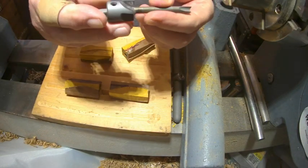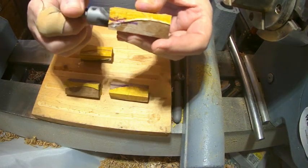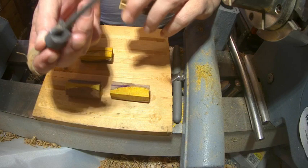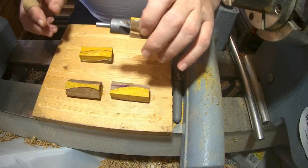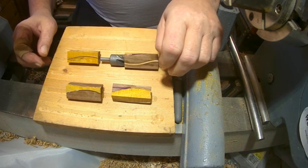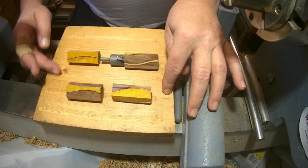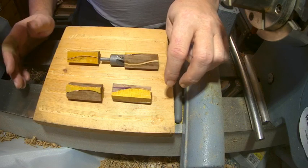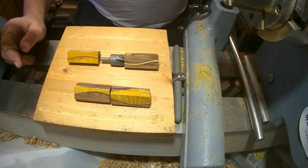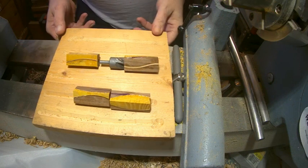These shafts are interchangeable, so that this is a 7mm that fits in there nicely. So when you're doing Sierras or Zetas or any other pen, you just change this barrel out, but the cutter stays the same. This bit of wood, if you get into pen turning and you're batching them out for Christmas or whatever, handy little thing. I made 2 of these, so I can actually get 12 pens on the go. And if they're segmented, it means I can keep the 2 ends of the blanks, if they're 2-piece pens, together. So, let me just put this out of the way.